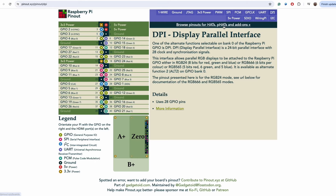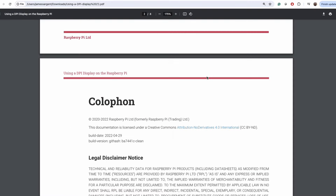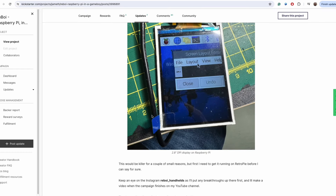There is another way of making small displays work without resorting to HDMI. The Raspberry Pi has a feature called DPI, or Display Parallel Interface. This is a native feature of Raspberry Pi and it produces a better video signal. So the old SPI method is deprecated, but we have a better method — DPI — already worked out. Well, I got a Reboy-sized display running over DPI months ago, and then I couldn't get the same display working with RetroPie, the operating system that I think everyone's going to put on their Reboy, because the current version of RetroPie is itself a little long in the tooth. There is no sign that RetroPie is going to get an update anytime soon to bring DPI support.